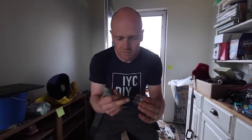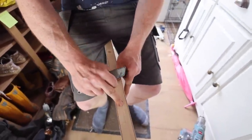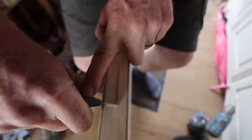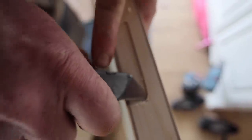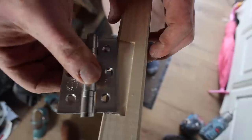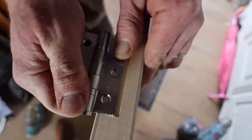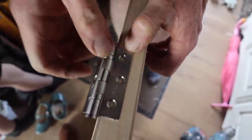So we've got our hinge here — it's a normal 75, 76mm hinge — and we're going to offer it up in a minute. But first, because it's a router bit it's round, and we've got to take off these corners. You can get a special little corner chisel or you can cheat and just use a sharp knife. Let's see how it fits — they've been pretty tight so far, so we might need to shave a little bit off. As you can see, that is super flat along there. We'll tidy up a little bit before we paint.